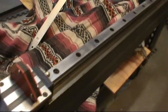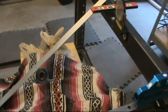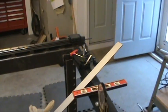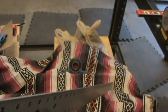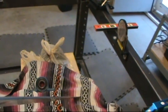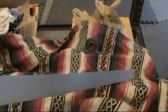The trucks that sit on the rails also have to be absolutely level. With my arsenal of tools — I'm a woodworker, not a machinist — I'm limited on what I can use to get things straight, flat, and level. For instance, this aluminum four-foot ruler: one would think it's flat and straight, but by the naked eye it appears to be yet it's not. So what do you reference from?